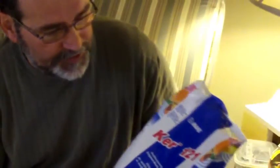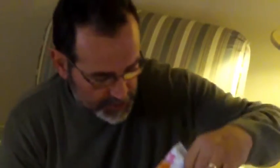To put the tile down on the floor and on the wall, you can pick up this kind of material at Rona. I think we paid around 25 bucks for it. It's a Mapei material, Kerabond 121, professional grade poly-modified mortar. And this can be used with mixtures as the instructions show to put the glue on the walls and the floor to hold the tile in place.